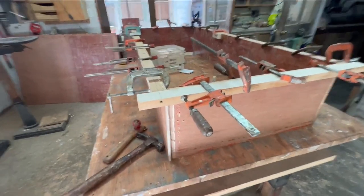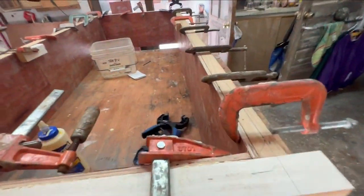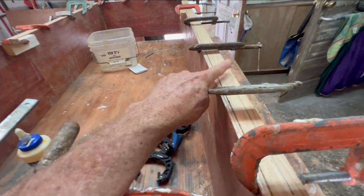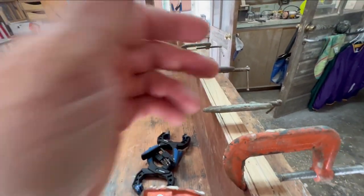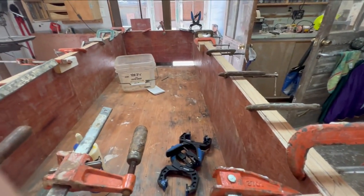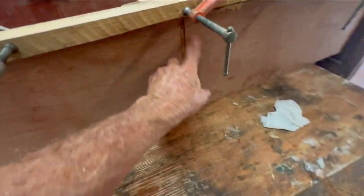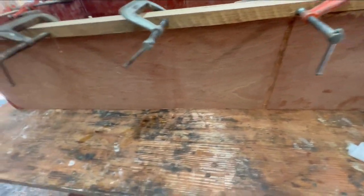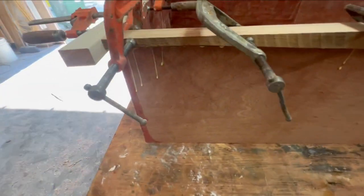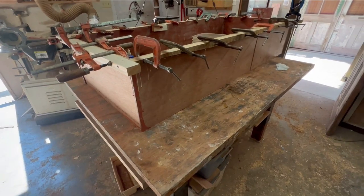The top flange and sides are together. This is 100% glue joint because I'm going to take a big roundover router bit and round this over so the fiberglass can round over easy. We didn't want to hit any staples or nails on the top edge, but the rest of it — the splices, the bottom, the inside — can be nailed, screwed, or stapled. It doesn't matter because this is what I'd call a waste mold. If it comes off, it's gonna come off in splinters.